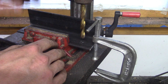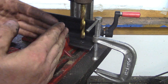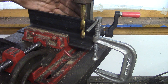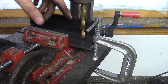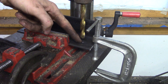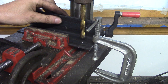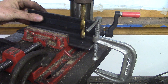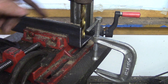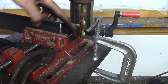Now, there's one thing to note depending on your application. You have to keep in mind that your zero points — your datum points — are the edge of this C-clamp and the back non-movable jaw face. So these holes that I'm drilling are not centered. This is a two-inch piece of angle iron, and this hole is not one inch from this edge.